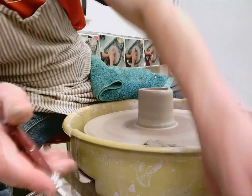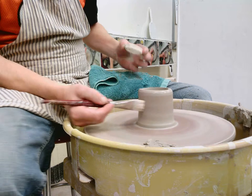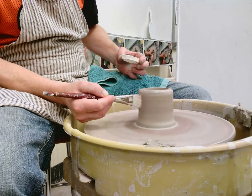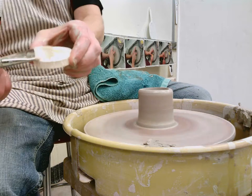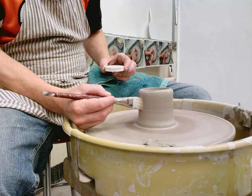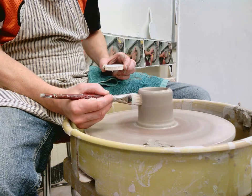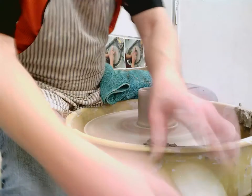Now I'm going to start painting the sodium silicate on the outside of the middle of this form. See how it's already getting messy? So if I put my brush right in the bottle, I'm going to contaminate the whole thing. A good couple of coats on there — make sure I've got it all set to go. My brush stays out of the bottle.